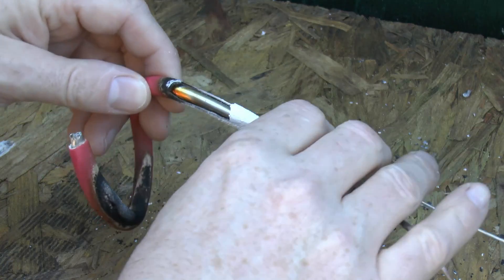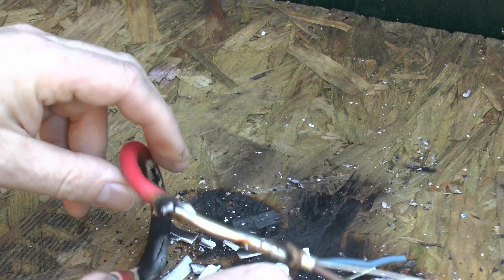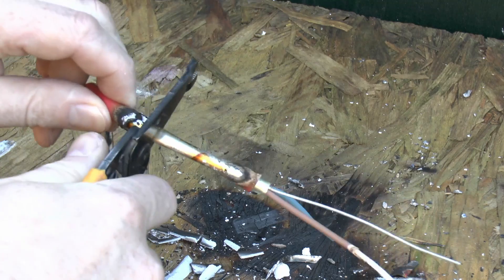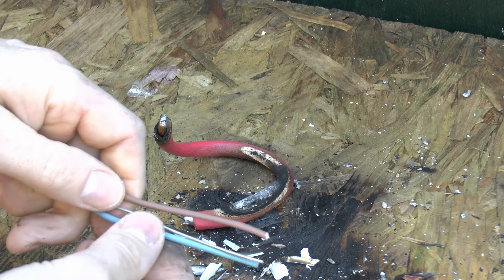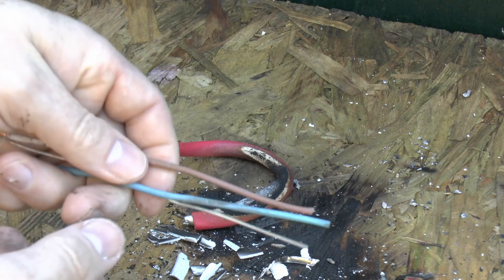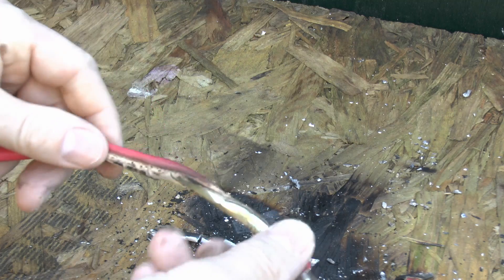After letting this cool down for a few minutes, we can see the outer covering has turned to a very crumbly, brittle material which just falls away. But note that the inner aluminium tube is completely intact — no melting or destruction of that at all. The cables at the end are pretty much as before. Now if we cut into this, slice the end away, and pull the outer aluminium covering away, we can see inside that the two inner conductors are pretty much as they were before any heating was applied — so no damage there. Any conductivity would have been exactly the same, and any circuit connected to it would still be operating.